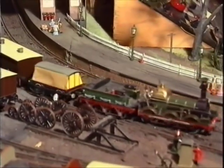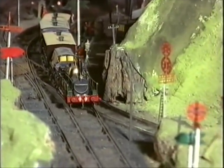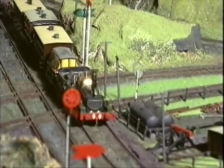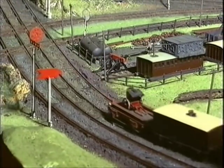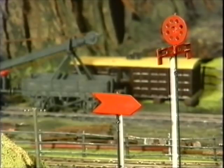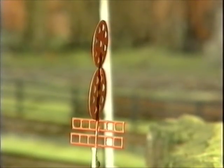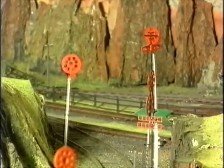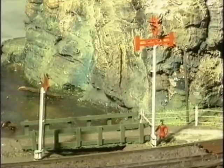It's an outside framed locomotive with the usual mixed variety of broad gauge stock. Broad gauge signals were based around two main types: a disc and bar, and a fantail or board-shaped signal. The permutations were that when the bar was showing with the arrow of the fantail pointing to the track it was dead stop; the arrow pointing away from the track with the disc was clear ahead; and the arrow pointing to the track again with the disc was a caution. The double junction shown here is in fact just a double disc and bar. The bars had several attachments to them, this one being a level crossing signal showing the bar top and bottom.